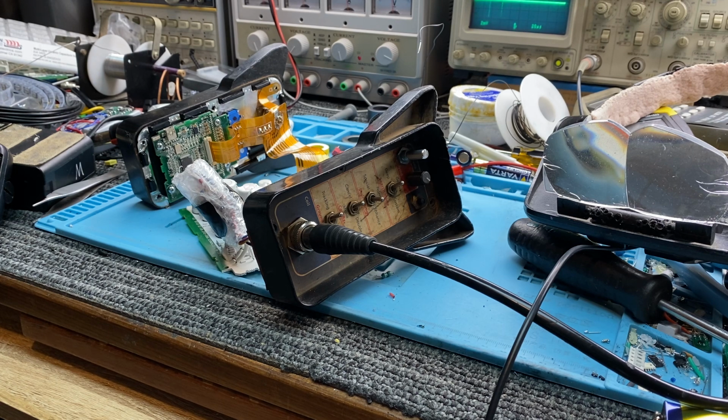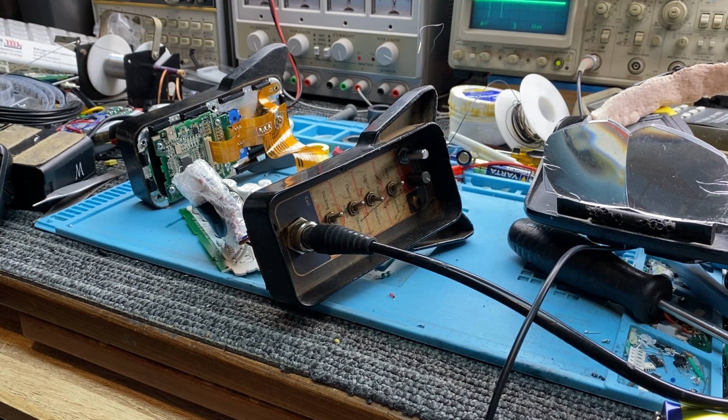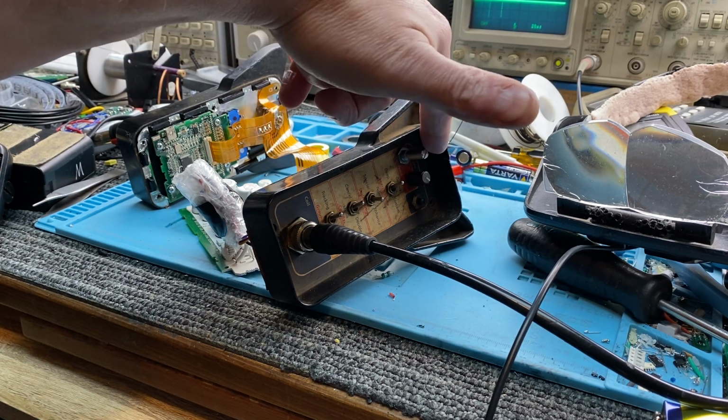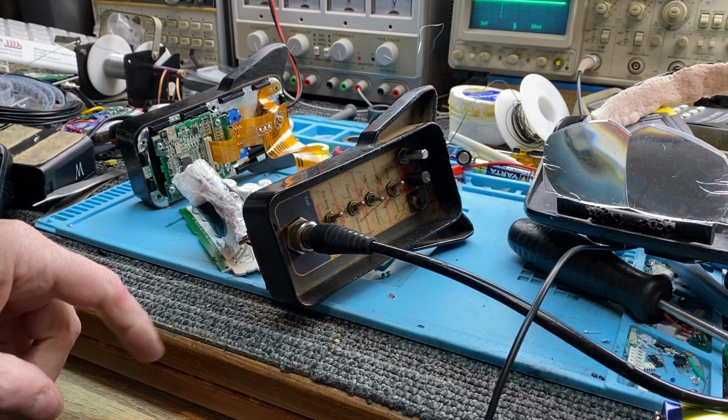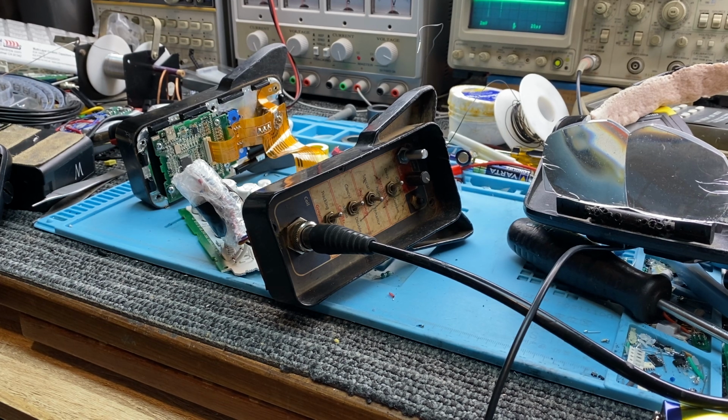It's very, very sensitive. I think in the last video I had to scrub the coil with a 0.05 to get the detector to even make a sound in normal mode. And like I say, it's in factory default settings except for the modifications. It has a variable gain added here, and I've done the electronic modifications to give it variable frequency. At the moment it's somewhere around the top end, I think up around 200 on the tuning, which is relatively fast. So that just gives an idea.